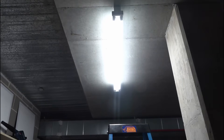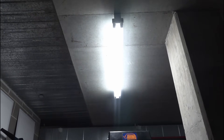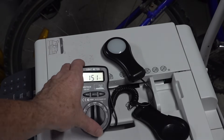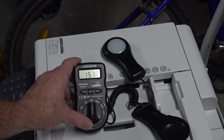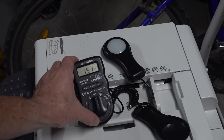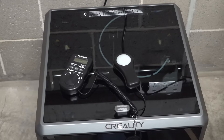These things are only about 2,000 lumens. You can actually get, and I have got now, supposedly 3,300 lumen T8 replacements for these ones. So I'm going to plug those in and see what difference they make. I can't tell by my Mark I eyeball, so I've got my light meter. Let's take some before measurements, then I'll replace the 2,000 lumen ones with the 3,300 lumen ones and see what difference we get. So, some random locations — this one is sitting kind of offset from the middle a bit, more towards the back wall — we're getting about 150 lux there. None of this lumens rubbish will measure lux because they're different measurement systems entirely, but it will give us an absolute difference. So 150 lux here on top of my 3D printer.